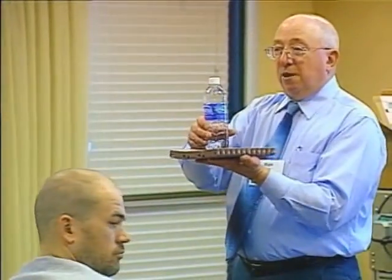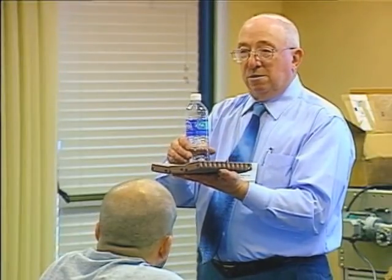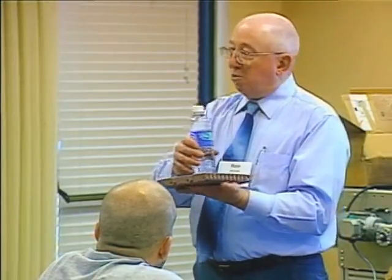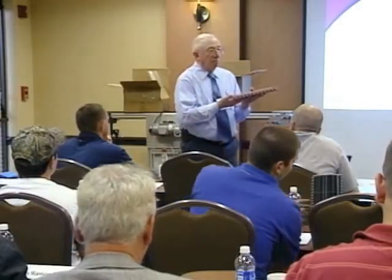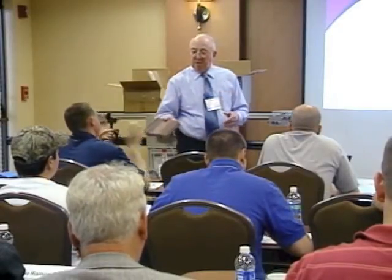And then when you're handling, if I may borrow this, when you're handling stuff like this, it transfers nice and easy. We talked yesterday, I believe, about how thin the walls are on this. I mean, there's almost no plastic in this anymore. You start accumulating something like this, and you can have some major problems as far as collapse of the container, especially if it's empty. So they'll use things like this, or in this particular case, this is acetal with a low friction ingredient added into it. Generally, either a Teflon or a silicone adder in here to reduce the friction between not only the belt and whatever support system is in place, but between the belt and the containers that you're carrying. So that's raised rib.